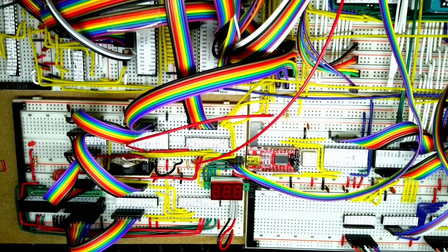The IDE drive is actually sitting on top of the floppy disk drive that I showed you earlier, so I just need to plug that in. Now, before we can use this, we still need to update the BIOS, so we need to add the XT-IDE BIOS extensions so that the BIOS can discover those at boot up. I think that's probably going to take a little while to do, so I'm going to end the video now, and in the next video we'll be sorting out the BIOS and hopefully being able to boot MS-DOS from the hard disk.